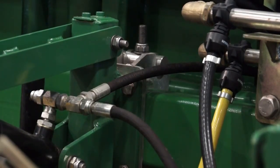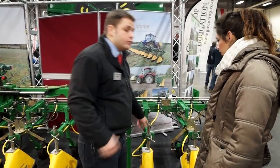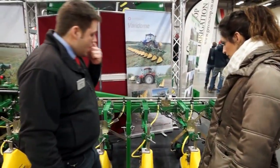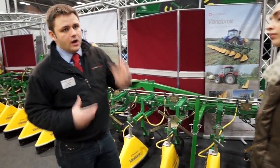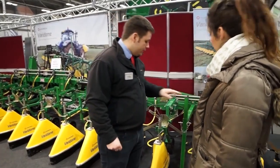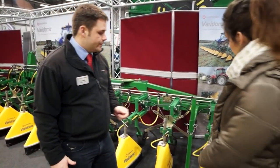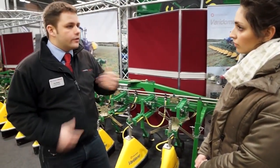When you look at conventional cropping, you can apply a non-selective herbicide through this shield between the rows of crop, and a conventional herbicide on top of the crop. That gives great advantages in weed control. In places where you don't have selective herbicides available, you have the ability to put a non-selective down to remove persistent weeds, and then the over-row application allows you to put conventional herbicides down — with up to a 60% reduction in chemical use, which is a huge saving.